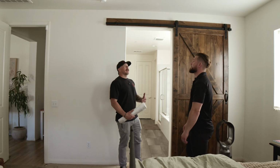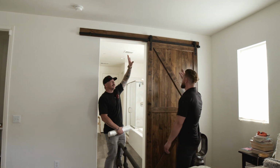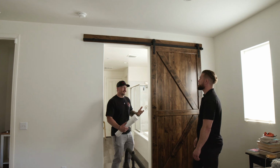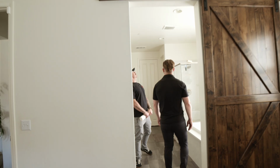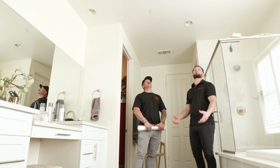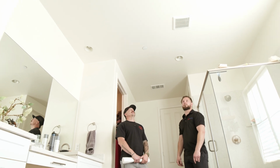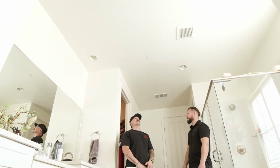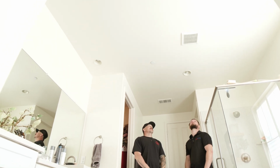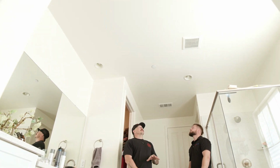Okay. So again, I'm very into aesthetics and making it look good. We could go here in this portion of the ceiling. I don't want to ruin the look of the barn door. Happy wife, happy life. So I'm going to step into the bathroom. There's probably some additional benefits about the bathroom outside of aesthetics anyways, with having high airflow within the bathroom with steam and humidity and bathroom odors. Be good to have a powerful fan. Exactly. You've got existing venting, existing lighting, bath fans that don't do anything anyways. So it's going to be another added benefit of putting the fan in the bathroom area.